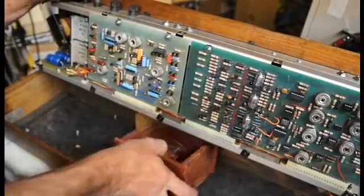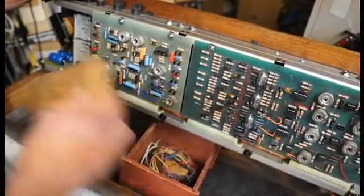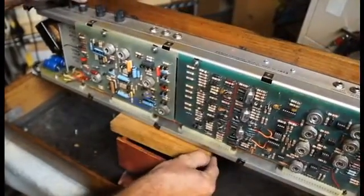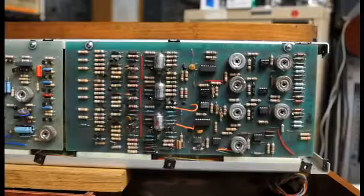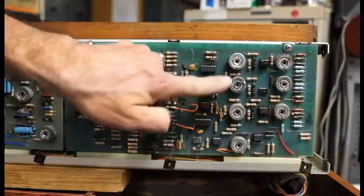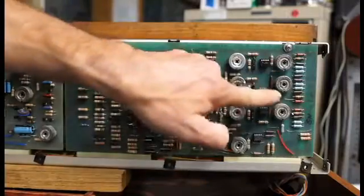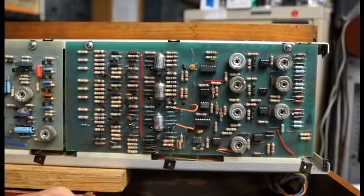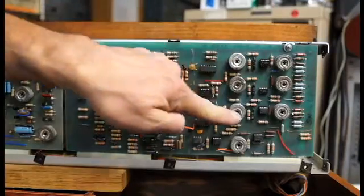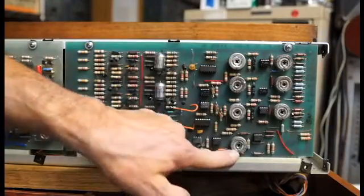I like to put a little block of wood underneath here as a brace to hold this up. In the Mini Moog, this is the oscillator board, and these are the trim pots that give us a lot of grief when trying to tune. We have the range and scale pot for oscillators 1, 2, and 3, and this is the octave trim pot.